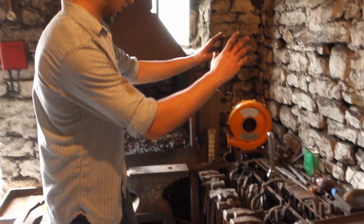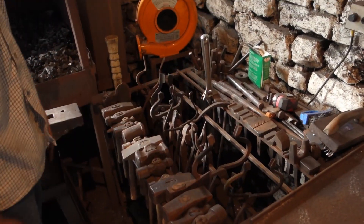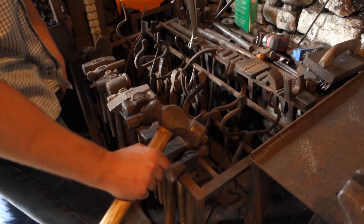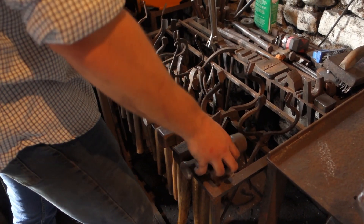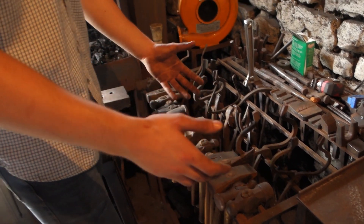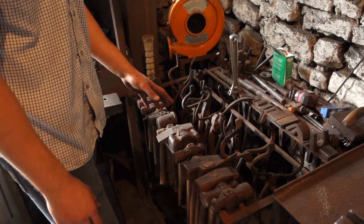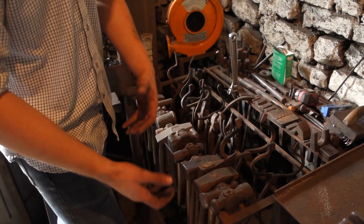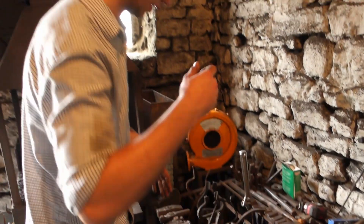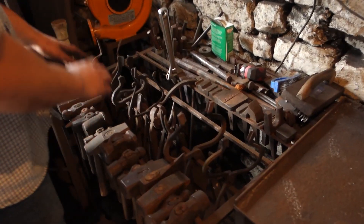Here's a big tool rack - probably a little bit too big, could be a little smaller. Lots of hammers down here; this is probably my favourite, which is a three pound ball peen. I also like this little two and a half pound one. I tend to use lighter hammers and do more blows per minute. I tend not to do heavy forging - more lighter stuff and bending, where a heavy three and a half or four pound hammer can really hurt your shoulder.